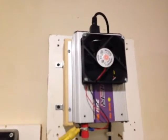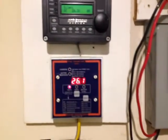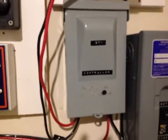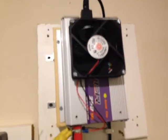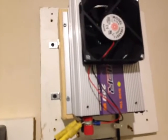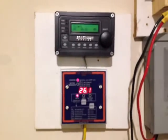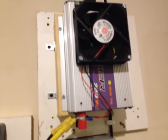In this situation, it's just in line for use with my GTI controller. When my batteries get to 26.3 volts, the GTI controller works like a diversion load controller — it will send power to this 250 watt grid tie inverter. The reason I changed it out is that I get more power from this unit; it kicks out 240 watts every time it comes on, whereas the other one was only kicking out just over 200 watts. My panels supplying power to the batteries are 270 watts, so getting 240 watts of usage in an on/off fashion is pretty good.